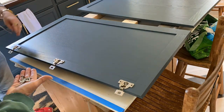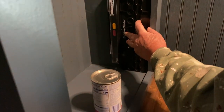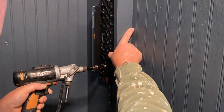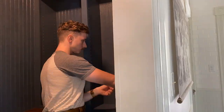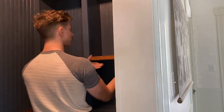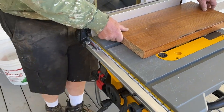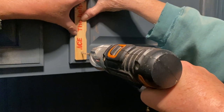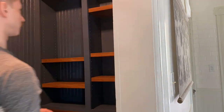Over the next couple of days, we finished out the project by pulling all the little details together. This cabinet hole template was very useful in drilling equidistant holes to insert tabs and make the chunky wood shelves adjustable — with cans and smaller items, two tall shelves feel like a waste of space, but two short shelves won't fit certain products, so better to have a range of adjustable sizes. We had some issues with some chunky wood pieces being too deep to fit, so they had to be ripped down a little bit. Cabinet doors went back on and got their final coat painted in place, but first we drilled the new holes for the hardware to avoid scratching the finished paint layer. Finally, I could insert the shelves and put everything back in its place.